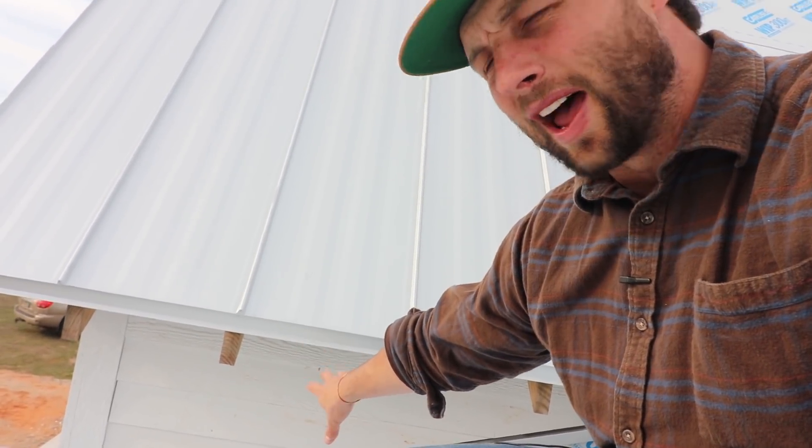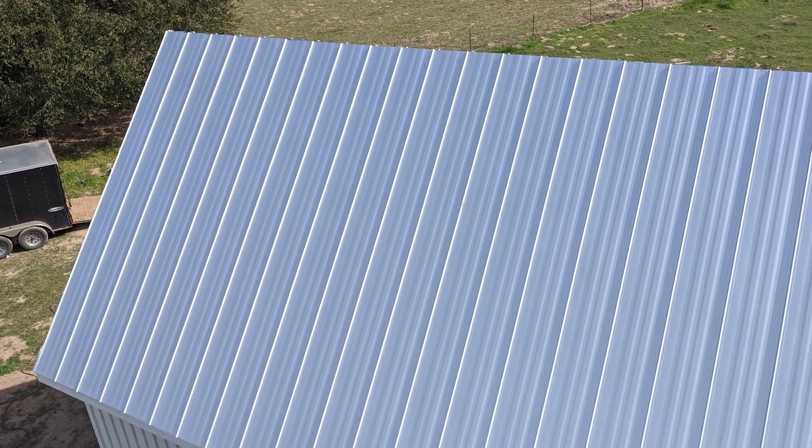Those rafters will all be painted, so it'll all blend into the siding back behind, and the Galvalume will look great. What do you think about standing seam? Do you prefer a color? How would you do it differently? Some people like putting batten strips, furring strips, or a board system on top of your roof deck to give ventilation. We're not doing that on this house because I think the striations are going to give us enough ventilation, and we don't plan on any leaks back in there — I don't have any penetrations through the roof. This whole roof is just one piece; I'm doing all bathroom ventilation through my gable ends. Would you prefer this roof be up on something? Think oil canning and other things.